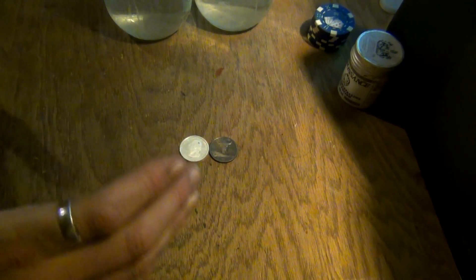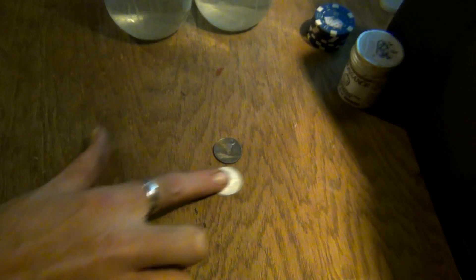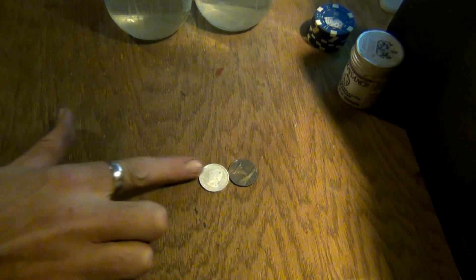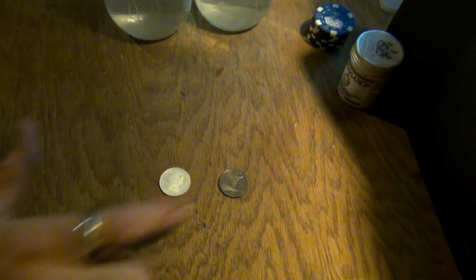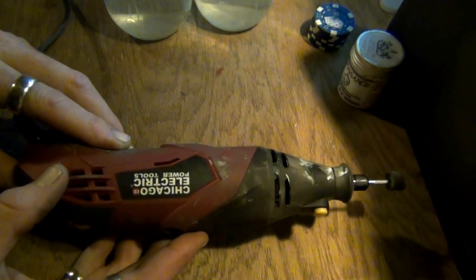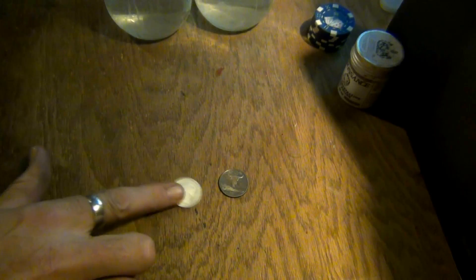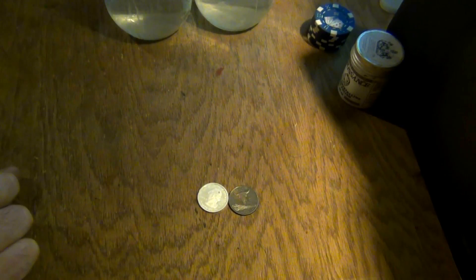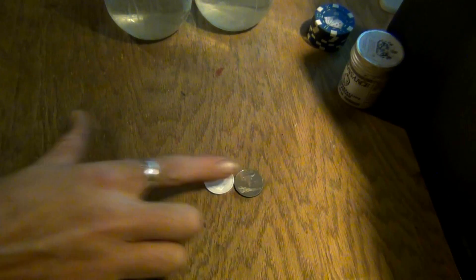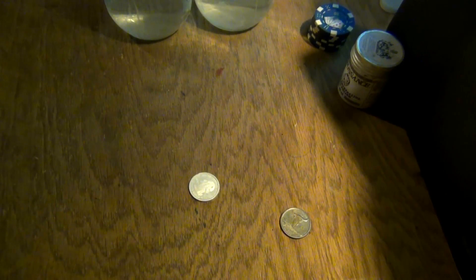When you're making a coin ring, you go to anneal it — heat it up — and instead of dunking it into fresh water, dunk it into your acid bath and you'll get this real frosty color when working with silver. Now how easy are both of these finishes to polish? The acid-quenched one is a lot easier to polish. The fresh-water one takes a little more elbow grease to get that carbon off. If you have a rotary tool, some kind of power tool or buffing wheel, fire scale and that frosty stuff both buff right off with some polishing compound. Without a power tool, that carbon doesn't come off easy at all — that's a drag to get clean. The acid-quenched one is a lot easier to get shining.